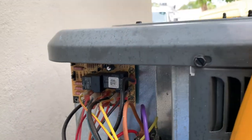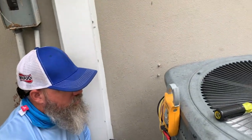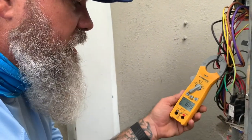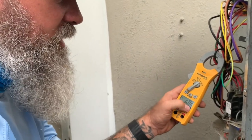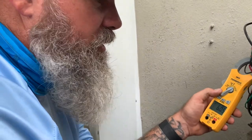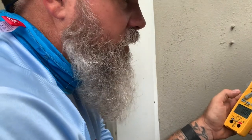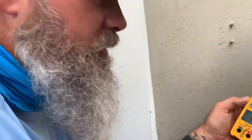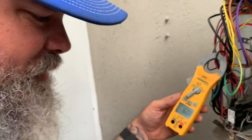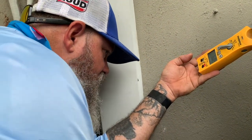I didn't hear it disengage when I disconnected that. Maybe it was stuck in heat — we're going to find out. So we did a lock rotor amps test — we hooked this up and hit our min-max, and we only got 22 amps on startup, which I think is low, but the compressor started right up. We didn't even cool it down. Right now it's only pulling 6 amps and it's rated at 12, so that's fine.